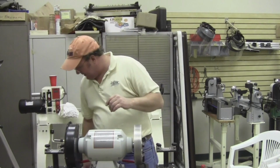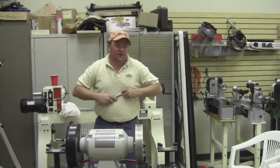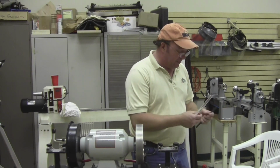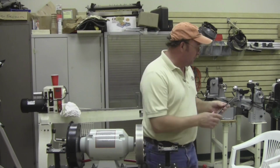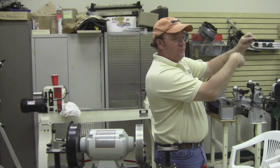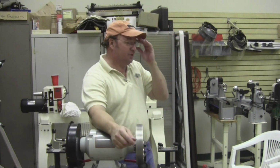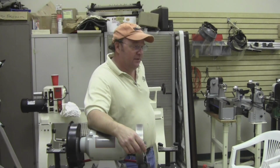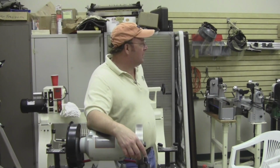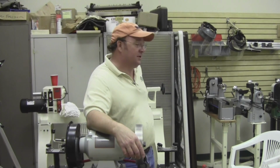We were talking about, let me see what else I've got in here. Here we've got a little 3/8 spindle gouge. This one needs to be resharpened, but this is one of the times that I'll use a multi-grind edge. I use this for doing finials and stuff, and it's a pretty narrow grind, but it's all ground back. I do that with just a jig. You can freehand them too, and it's dull right now. But you can actually use that almost like a skew. The top of it has a really flat fingernail grind, and you can use it like a skew.